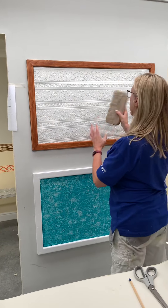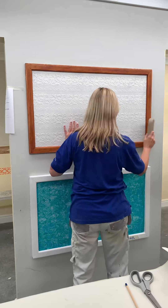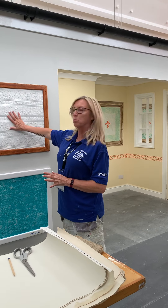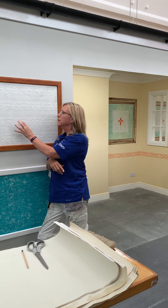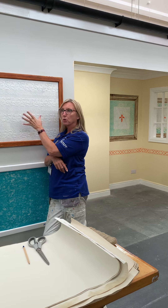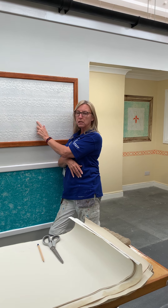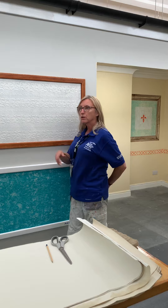I'll get my smoothing brush and again smooth from the centre out to the sides — that's one finished panel. Each of you are going to do your own panel, applying blown vinyl onto the one you've glazed white. Remember, blown vinyl is PVC applied on top of paper to create an embossment. This paper can be painted and used on walls that may have cracks or indentations, so it covers up things like that. It's not good for high traffic areas such as staircases because it scratches off. It's great for ceilings and walls that aren't going to be caught all the time.